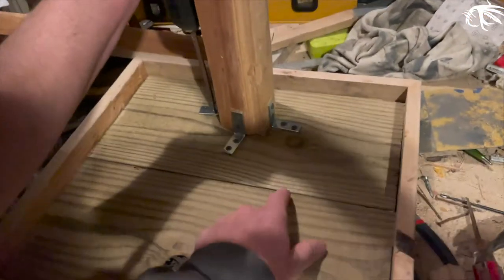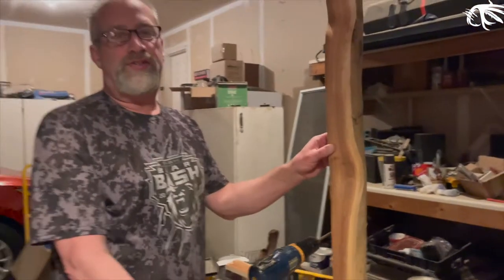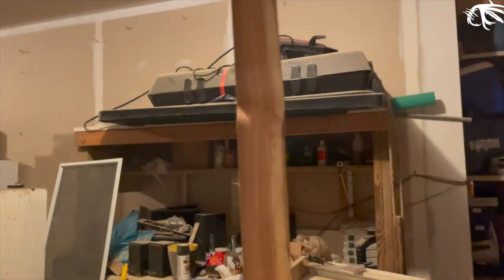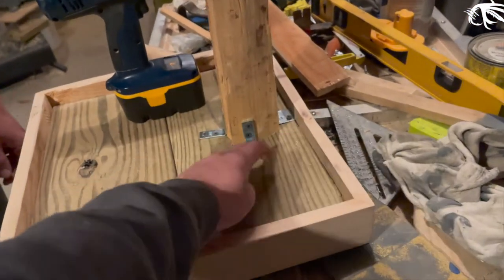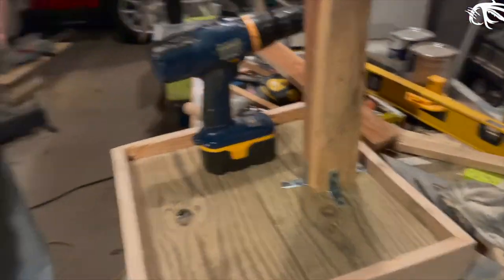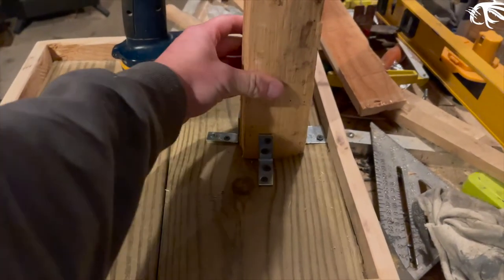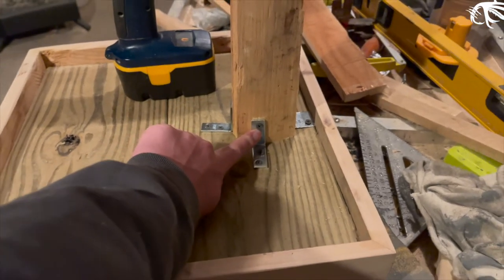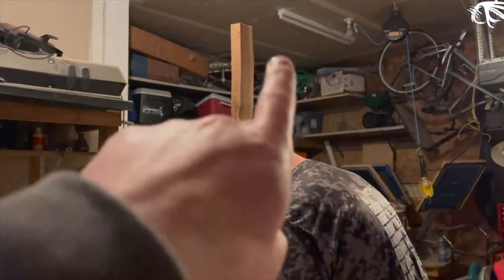Dad's putting in the owl brackets. We've got this old fence post — dad picked it up from Menards. It's cedar split rail fencing, and it's got these cool waves in the wood. We just took some L-brackets and put it to the base, measured halfway in between, and that's where we put the brackets. All the brackets will be covered up by foliage anyway. A good tip: when putting screws into cedar, just snug it and don't tighten it super tight, because it'll strip — it's a real soft wood.